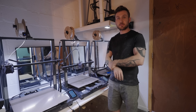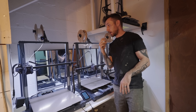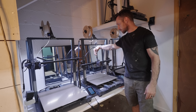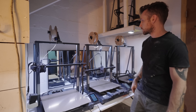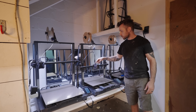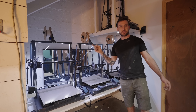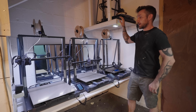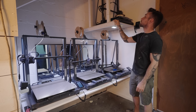Chris from Tofu Auto Works — if you watch our channel, you'll probably watch his channel too, he's building a sick GTR setup right now. He's running these exact same printers and used a piece of aluminum zip tied to the back to keep the cable sticking up and out of the way instead of folding down. That works too. We emailed Elegoo after our second one had issues — it's not blowing up, it's literally just the hot end running over the ribbon cable and melting it. They sent us new replacement cables.